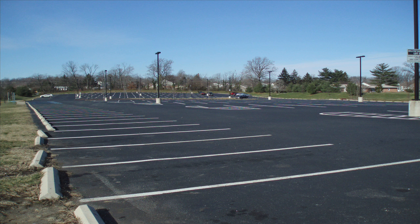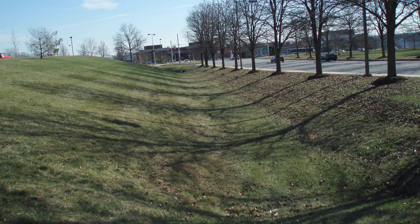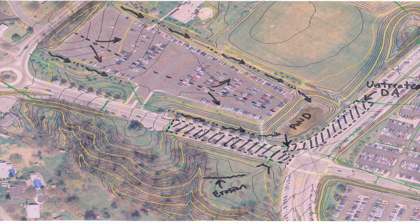It's time to consider what retrofits might work. There are several opportunities to design on-site retrofits here. For example, we could propose that bioretention parking islands be incorporated into the parking lot. Another option could be to retrofit the grass swales to promote infiltration and improve water quality by replacing the underlying soil media and planting native landscaping in the channel. However, inspection of the site revealed that, by design, runoff from the parking lot is already being treated by the stormwater pond. If we were to propose these on-site treatments — the parking island or grass swale retrofits — we would, in essence, be duplicating treatment of the parking lot runoff, which is not likely to be the best use of limited watershed restoration resources.